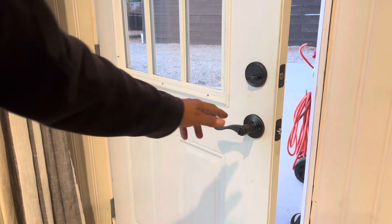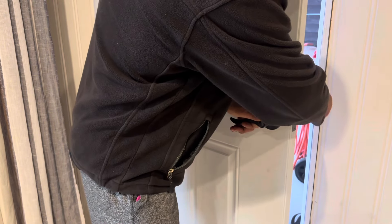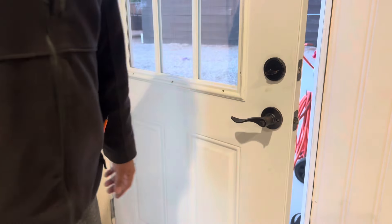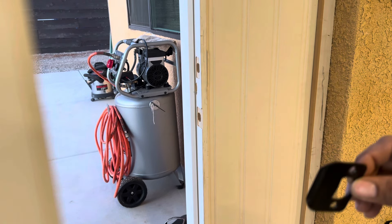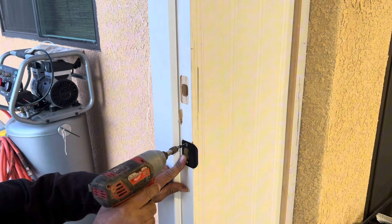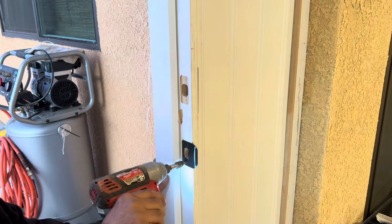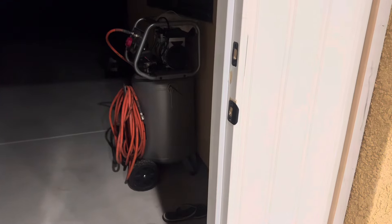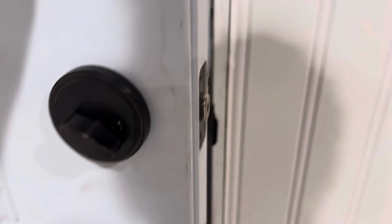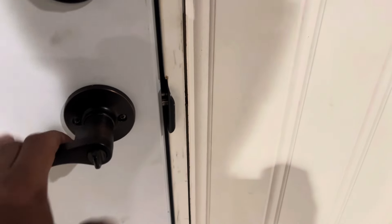Now the next part — we have to put the other side, the two metal strike plates over here, so they don't damage the wood piece. We also have to be very precise with the alignment; these have to go in to lock smoothly. There are two different pieces — one goes like this, that one goes on the bottom. Now I have installed the side plates. I had to make a small adjustment at first because it was too far in and wouldn't lock. After the adjustment, the door locks and unlocks — that's it.